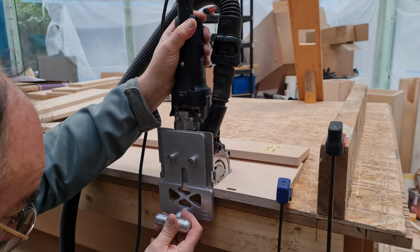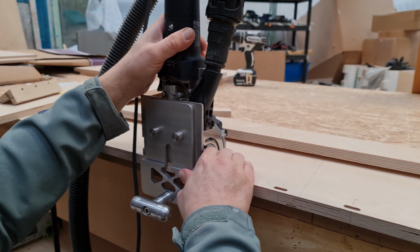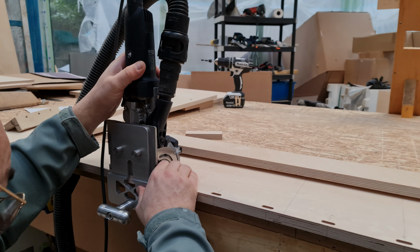With all but the 4mm cutter, the cutting starts pretty quickly on the stroke, so take your time. With the 4mm cutter, it is 10mm shorter than the rest, and so there is some travel before making wood contact, and it's very easy to become impatient and trash the surface of the thinner 12mm ply.